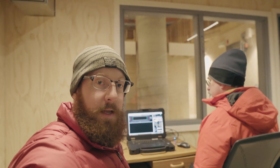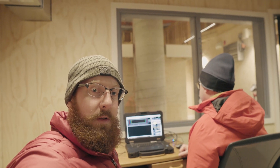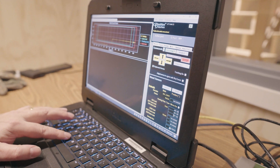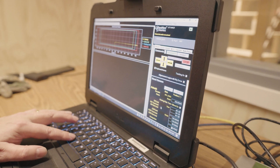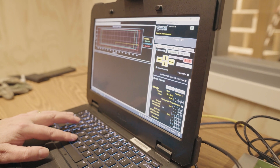We're powered up and connected to the telescope using the USB to Ethernet adapter. Everything's connected. We're following along in the PWI2 software user manual and we're going to calibrate the sensors and do a little bit of user training once we're fully initialized. We're doing the azimuth rotational calibration now — we backed the motor off by about 20 degrees and we're inputting that into the azimuth counterclockwise limit, track limit, and go-to limit, and we're going to click save.